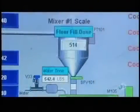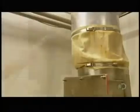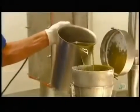To make a waffle cone, they start with a lot of dark brown sugar. They add caramel coloring, along with some secret flavoring ingredients. They pipe water into the blender. It's ice cold to keep the batter from getting too sticky. A computer controls the flow of flour into the mix from a tank a floor above. They add vegetable oil as a giant beater mixes all the ingredients.